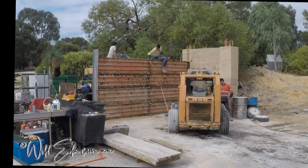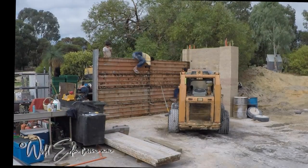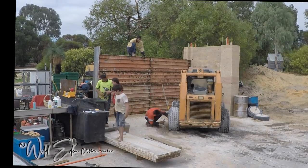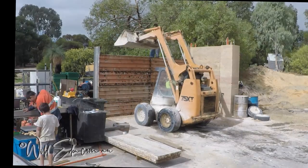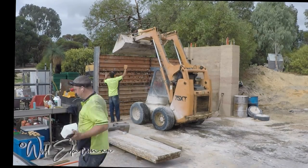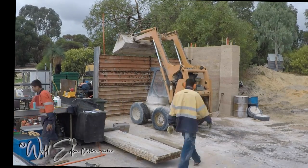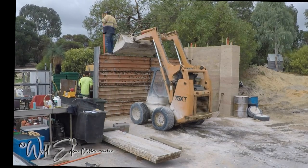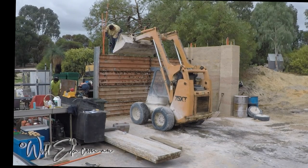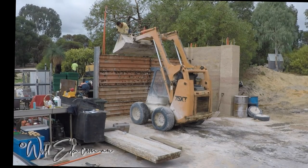As you can see they're tightening up and putting vice grips on. Now we're going above the doorway — remember where that doorway was. He's still got a little bit to ram on the left to get up to the doorway level. Once we get above the doorway, we've got to remember to put our infill reinforcement in. Make sure you watch the infill videos — if you're a subscriber you'll have more specific detail. We don't use lintels and have never used a lintel; we use reinforcing.